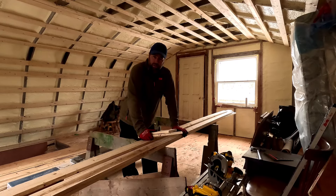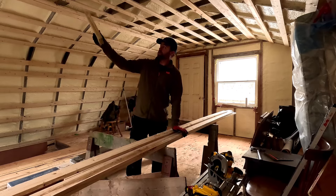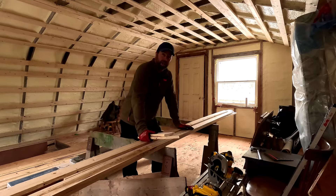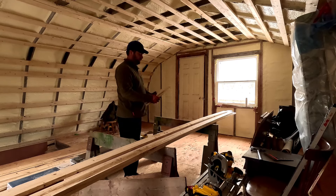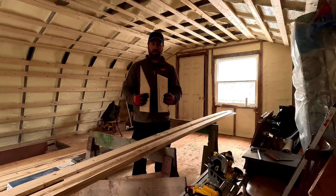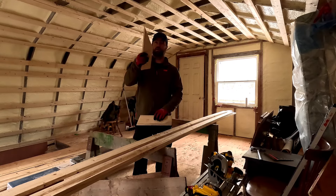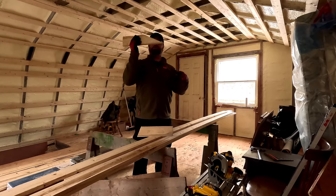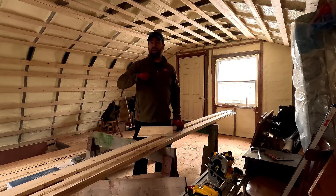Strapping is not exactly a hard job. You can make it as complicated as you want. All I do is use a level, and where I can't use a level on the ceilings, I use a measuring tape in order to get my spacing. I pick a spot to measure from and choose my spacing — and it's that simple. Once your first string's on, your second string starts off your last string and then you make your measurements for the last one. But when you're doing the gable ends, there's two different angles you have to be concerned about, so I made end jigs. They have two different cut angles on them — this angle is the angle of the roof as it goes from the floor to the corner, and the rest of the upper part of the roof is this angle. We're going to use these to start our pieces into the corners and take measurements out from there. All I'm going to do is use a pencil to mark where I want to go, cut it off, nail it up, and go.